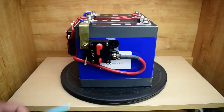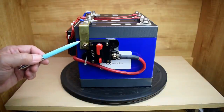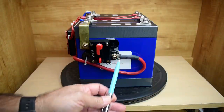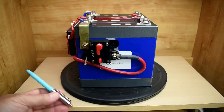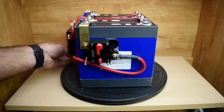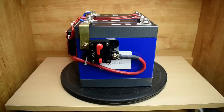I also made sure the heating problem was not the result of a high resistance or poor connection between the post and the plate, and the post and the lug connector for that number four wire. I'm going to connect up a power inverter off to the side and do two tests: a 150 amp test first, with my thermal camera looking at the breaker, and then repeat it at a much lower current — around 68 amps. Let's get started.